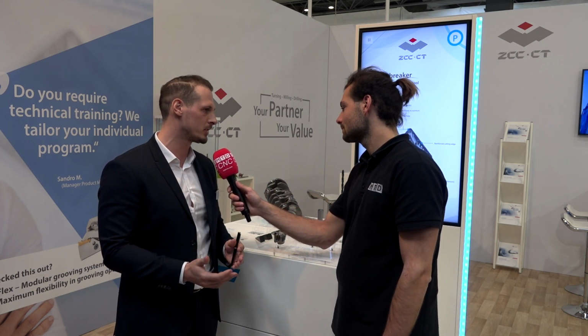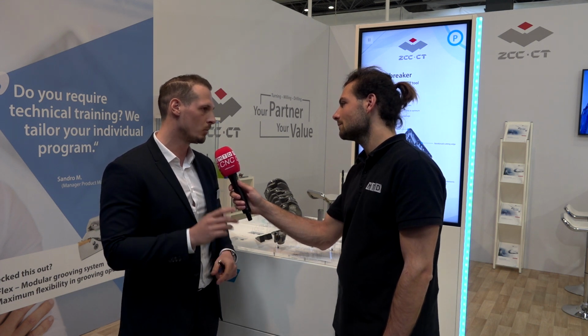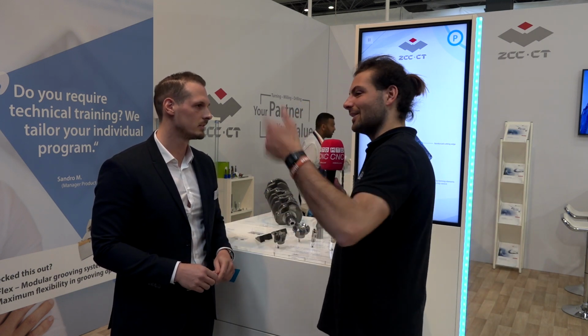So Sandro, what would be your first choice if you had an interrupted cut? Interrupted cut, I want to go with the YBC 203 because here we have an excellent balance between toughness and wear resistance. And you have also to focus on the feed rate. But when you have a good combination between the chip breaker and the grades, YBC 203 with XM chip breaker will be the first choice. Okay, so obviously when you're in an interrupted cut, you almost don't need a chip breaker because those chips are breaking anyway. But the chip breaker is critical if you're machining a nice big straight diameter and it's swirling off all over the place. You definitely need a good chip breaker.